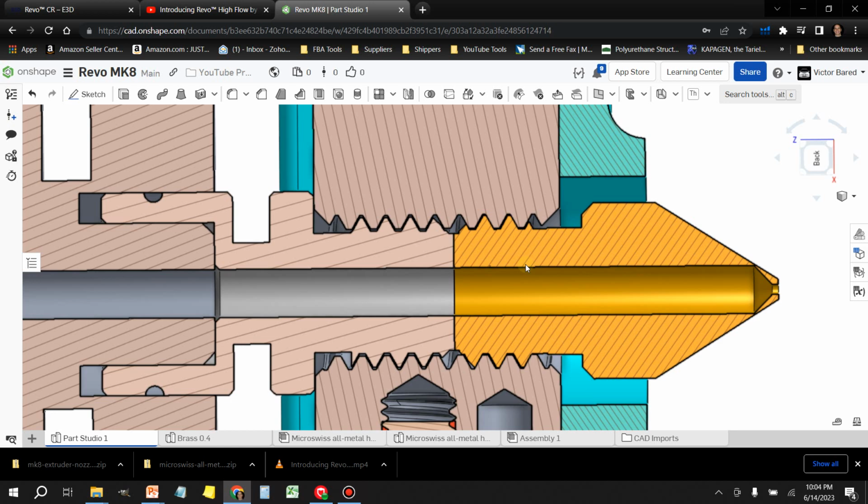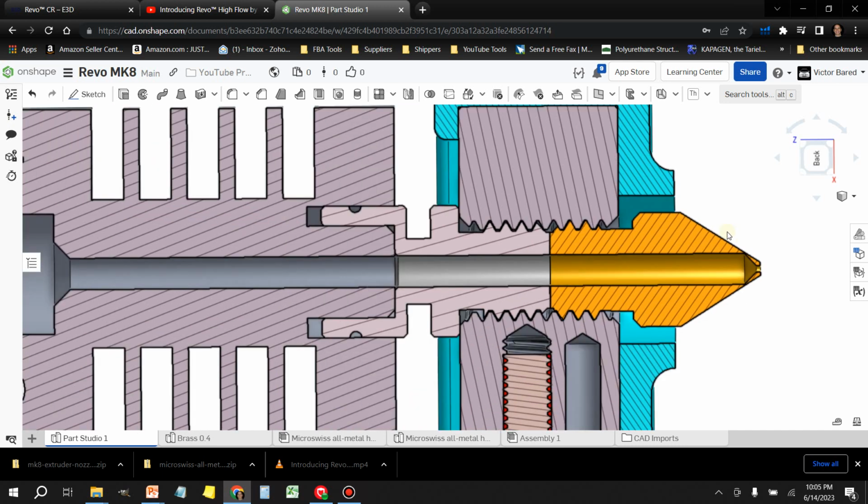And once it's tightened, you really can't fiddle too much with this nozzle when it's hot. So if you get a lot of residue built up around the nozzle and you're trying to use a brass brush to remove some of that debris off of the nozzle prior to your next print, chances are you're going to loosen this nozzle over time. And this has happened to me on several occasions. And the primary reason why I tend to stick with Bowden, because the Bowden tube can provide that extra level of pressure to keep this seal's integrity.